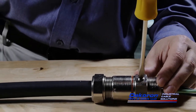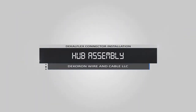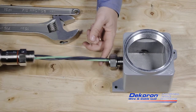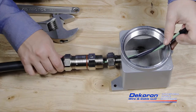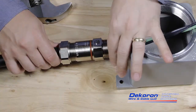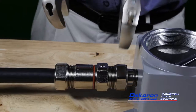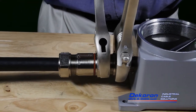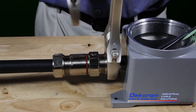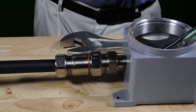The cable is now ready to be attached to the hub and enclosure. Begin by threading the conductors through the hub and into the enclosure. Once the hub nut is hand tight, place a wrench on the hub nut and on the barrel nut. Fully tighten the hub nut to the connector in this fashion. This completes the Decaflex connector installation.